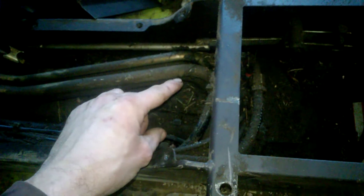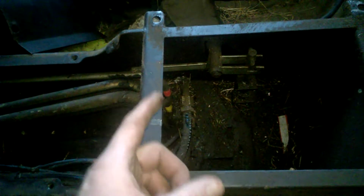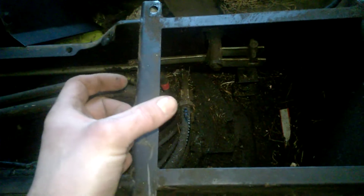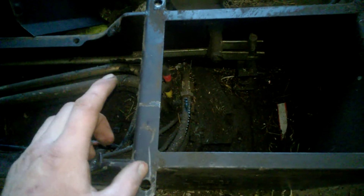So underneath here is the opposite end of this, which is an ordinary kind of end. But then onto the pipe is what my mate calls a repair coupler. So it's actually a hydraulic pipe, but it's got a thread on the inside of it, so the pipe is actually twisted onto the coupling. Unfortunately that doesn't work when you're trying to turn a seat round - every time you try and turn the seat round it actually slightly undoes it but never quite nips it back up again. So I've constantly got an oil leak underneath, which is hydraulic power steering fluid.